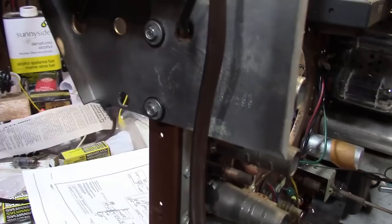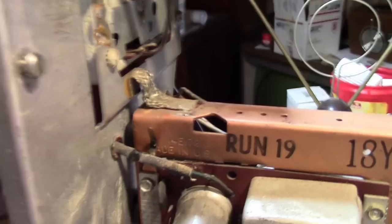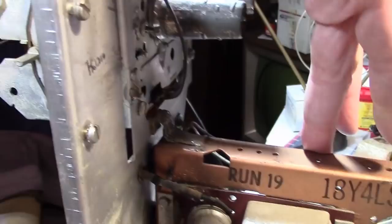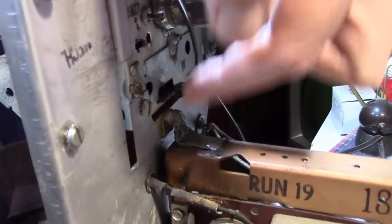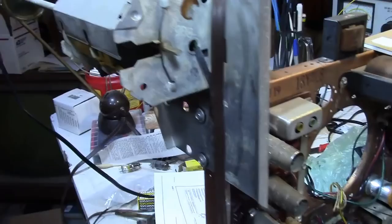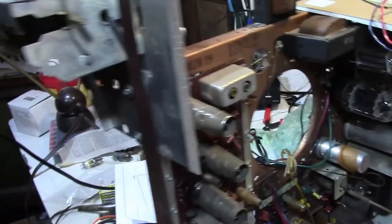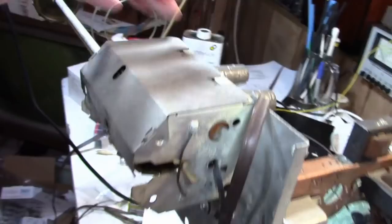So why go to all that trouble? After all, this subchassis is ground and this chassis is ground — why not just bolt the two together? They are connected together with this heavy braid. Well, I can think of three reasons. One: this subchassis is aluminum and this is copper-plated steel — if you have two dissimilar metals attached together you can get galvanic corrosion. Two: to eliminate ground loops. If you have several points of contact between metal surfaces and there is any current running through them, some connections will have lower resistance than others, setting up ground loops and causing interference. Three: microphonics. This speaker attaches to the cabinet, this chassis attaches to the cabinet — with the sound cranked up, the cabinet vibrates, feeding through to the mixer oscillator tube which has delicate elements inside, and that can feed through and you get sound interference inside the picture.